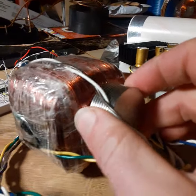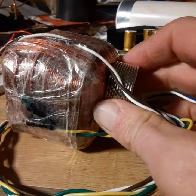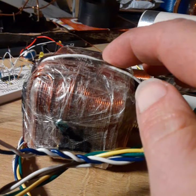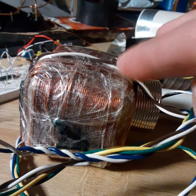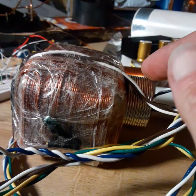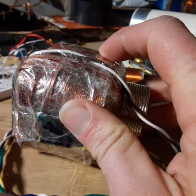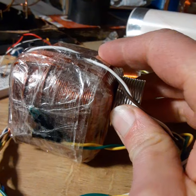Here's an iron cube — two inch square cube — and I've wrapped it with magnetic coils on all three axes. I powered up two of them with a 90 degree phase difference, so it makes a rotating field. Then I stuck the magnets on one side, trying to unbalance that, and this also created movement.